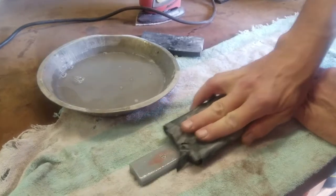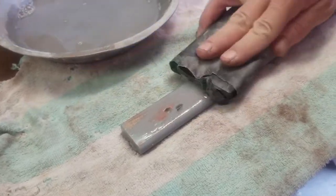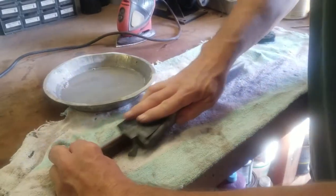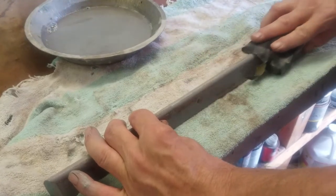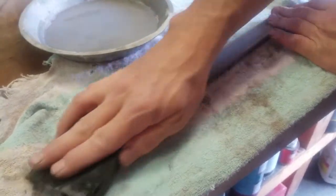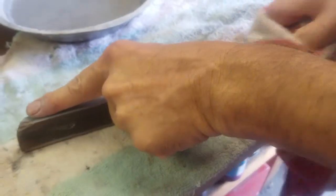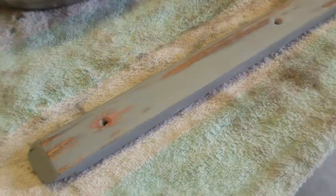Here I'm wet sanding with 320 grit sandpaper. There's a little bit of Dawn dish soap always in my water — Dawn works really well and tends to remove any possible oils from your hands. I sand the whole thing out. You might think you're going to get water in the wood, but you won't — first of all it's Arizona, it's pretty dry, and second, we already sealed all that wood twice with sanding sealer, so virtually none of the water gets in. I'm using two different sanding backers: a hard pad for flat surfaces and a foam pad for the rounded front surface. Wiped it off with an old rag — this is the result after your initial sanding.